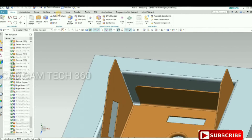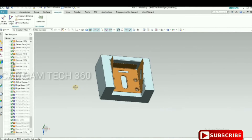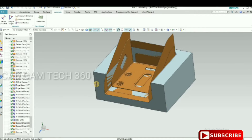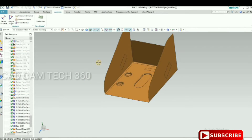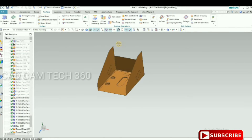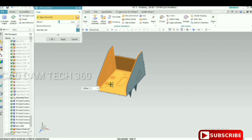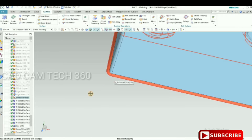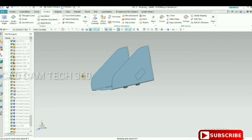I am going to check the sheet metal thickness. We are going to use the same sheet we used to make the die — that sheet we have to use for the punch. We should offset 2 mm for the punch.